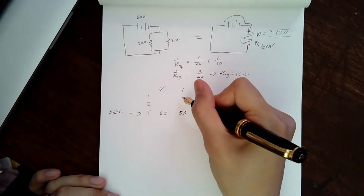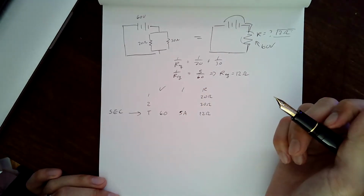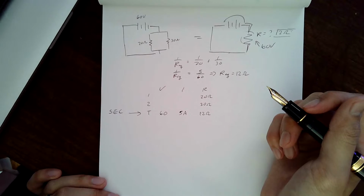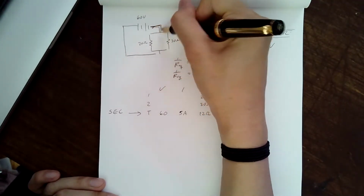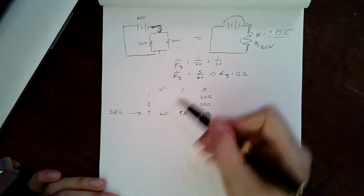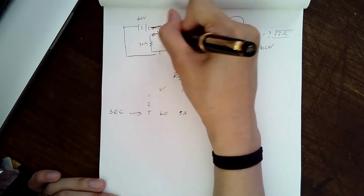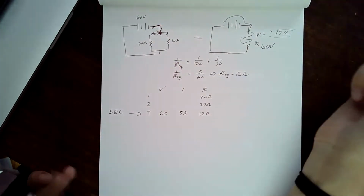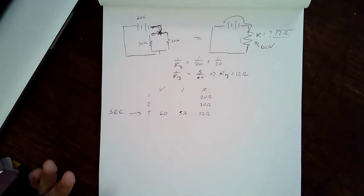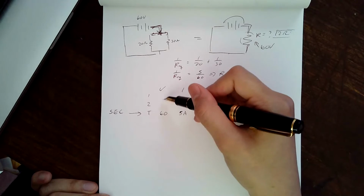Does that mean I can just do 5 and 5 here? No, because this is a parallel circuit. So if I have 5 amperes going through this way, I actually now have a guarantee that both of these are less than 5, right? Because the 5 has to split up at this junction right here. How does it split up? I do not know, okay? So to do this, we actually need to solve for the 2 voltages first.